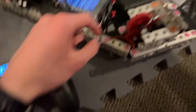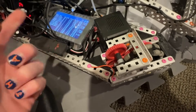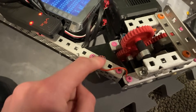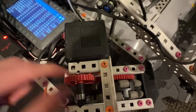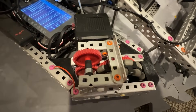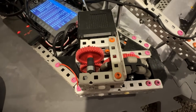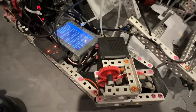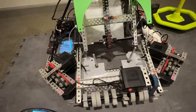Some other features of the drive base: we had to ground it, because these 3D prints do not transmit electricity, so static would build up on these pods and zap the brain port of one of the motors. So you always need to electrically ground them — we have two ground wires per pod: one main one, and a smaller one right there. This is all electrically connected. It's standard 3-hole C-channel, and this is 360 RPM blue motors. Because X-Drives are sqrt(2) times faster, it ends up being about the same speed as running 600 RPM direct on 2.75-inch wheels. On 8-motor drive with this robot at around 15 pounds, that was a pretty good speed. The robot is really wide because originally we had room for an entire robot to fit inside of it — check out our buddy hang explanation video linked in the top right.